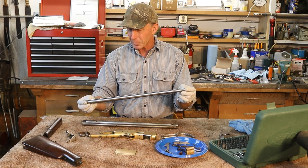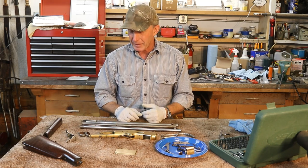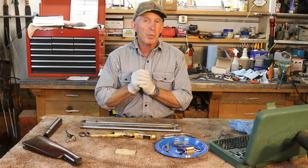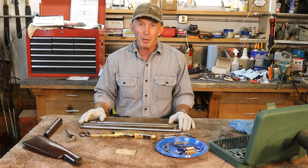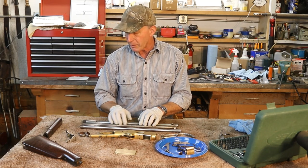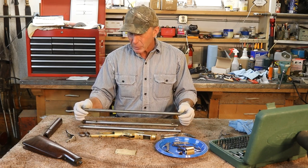I've got a couple of barrels ready to order from them right now. What we're going to do now is put some finish on this thing, because we've got this bright, shiny new barrel that doesn't match the patina of the rest of the gun. This particular saddle ring carbine has been completely cleaned — all surfaces, zero original finish. So we're starting with a clean slate, which makes it easier because we're not trying to match the original finish. They've done some polishing work and the pits have been removed.